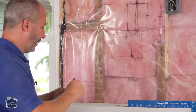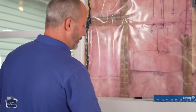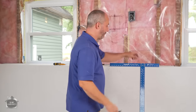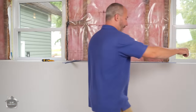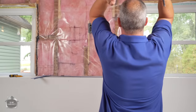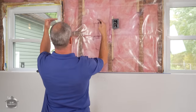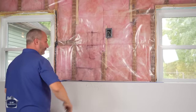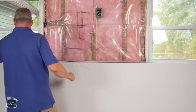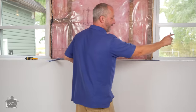So when I'm making my drywall here, I'm gonna be taking this sheet, putting it over, and lifting it up so I can write door side. And I know when he's giving me a measurement that this door side is gonna be the square side, that's gonna be the cut end, because we're gonna pick it up and go like this and install it this way, okay? I don't know if that made a lot of sense, but let's try that one more time. The door is over here. So we're gonna pick the sheet up, rotate it, just like in the picture, and lift it up. So my door symbol would be on that part of the drywall. So when I'm installing this, the other end here ends up down here. On the square wall, we're not cutting. We're gonna cut the other side in case these dimensions are different.